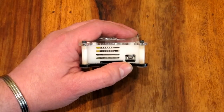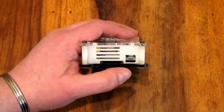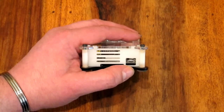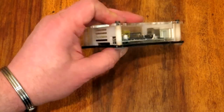There's a micro B USB power adapter here, so there's no on-off switch as such — you literally plug in and unplug. This connector is commonly available through old mobile phone chargers. In Europe there's a standard where micro B USB power supplies are all the same voltage and they work absolutely fine, so a BlackBerry power supply will do the job nicely.